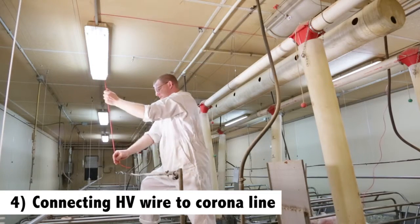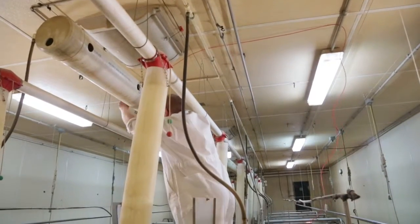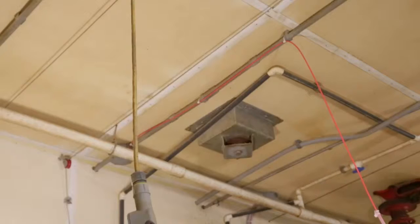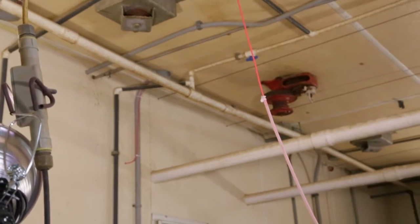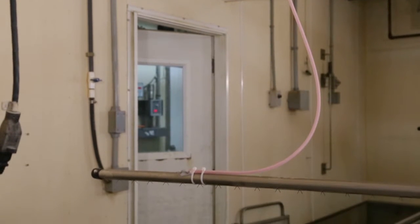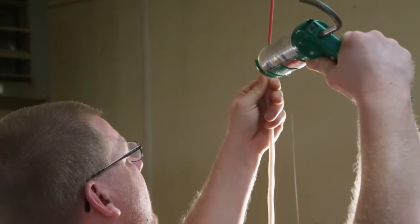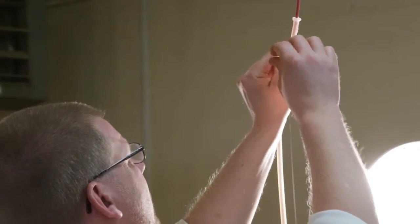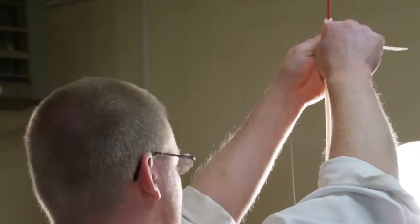Run the high voltage wire to the corona pipe nearest the power supply high voltage switch. There must be enough slack in the high voltage wire to allow for maximum travel up and down. The high voltage wire cannot touch any object as it drops from the ceiling to the corona pipe. The high voltage wire touching the energized corona pipe runs must be covered with a 4-foot section of silicone tube. The tubes must be sealed with silicone caulk and zip tied snugly to prevent water from filling the tube. Repeat this process for each end of the high voltage wire touching the corona pipe runs.